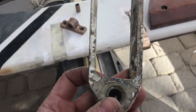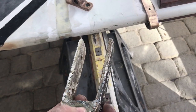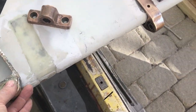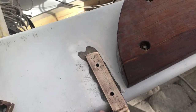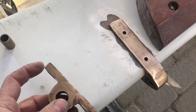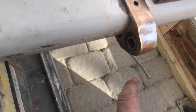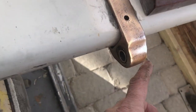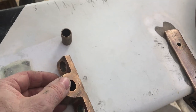For the top gudgeon, I was able to acquire a couple of these smaller ones made of bronze from someone who happened to have them on hand. One is all painted; I did get the paint off of this one - I just sanded it a little bit. I had to sand back the gel coat to dry fit it. It's going to go with one of these original five-eighths gudgeons and I'll put the pin in there. There's actually a little bushing in here which comes out, so I could use either a half inch or the five-eighths on this.